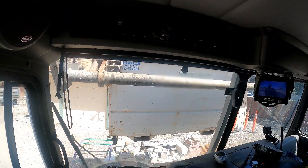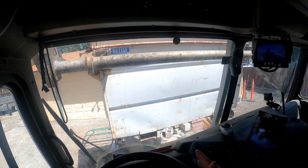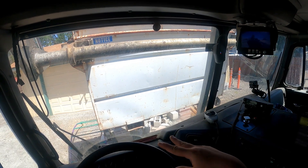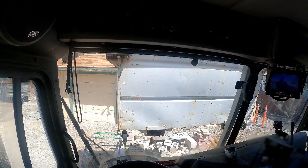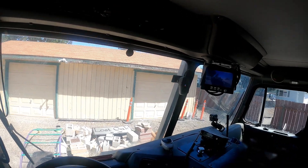When you bring it up around windshield level, tilt the forks down. Basically, in my opinion, when you're dumping a bin, that's about the position of the bin. Because if you level up the bin, then you won't have anything spill on your windshield or break your windshield. Bring it all the way to the top and just dump it.